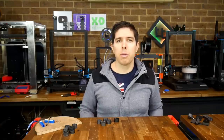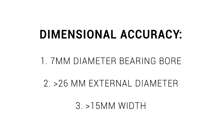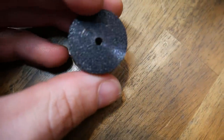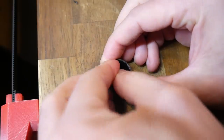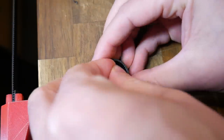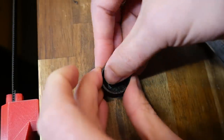Eventually I did get there, but were the results worth the extra effort? First up, we're testing for dimensional accuracy, and there are three crucial elements. The first is a test fit of the 7mm bearing in the internal bore — and I'm pleased to report that on the print-then-machine version, it's a very snug and perfect fit. How does that compare to a version which is entirely 3D printed on a printer with a small nozzle? Unfortunately, the bore for the bearing isn't quite right, meaning the model or the slicing process would need to be adjusted to give the correct clearance.